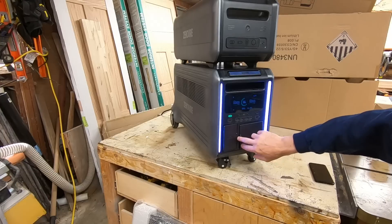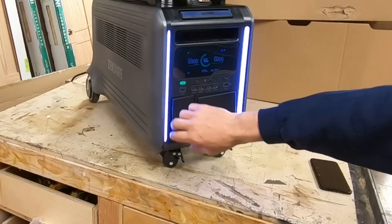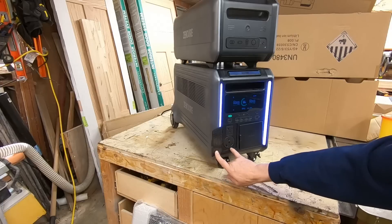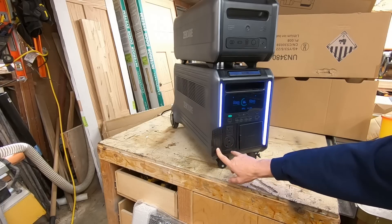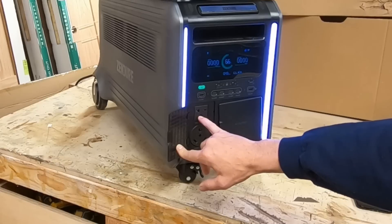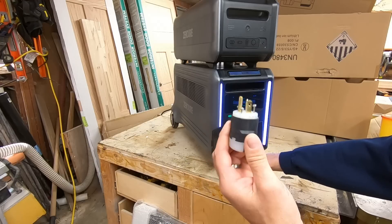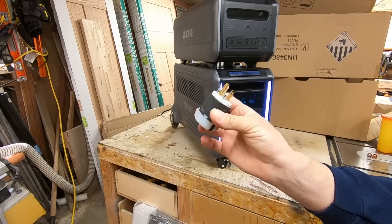This thing's been working great. It's kind of cold out, in the 30s right now. They've got two doors here - this door has a bunch of 15 and 20 amp receptacles. There are different modes you can set up in the phone app and I'll show you how that works. This here is an RV plug - 120 volts, 30 amp max. This here is a 220 volt plug with a 16 amp max.